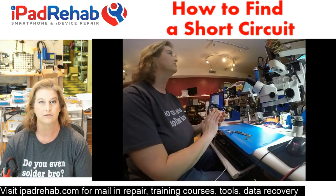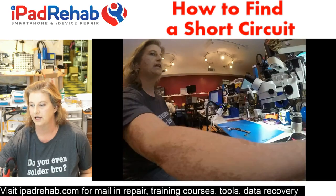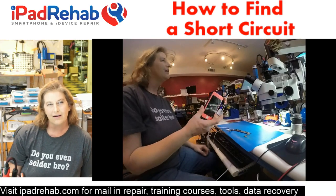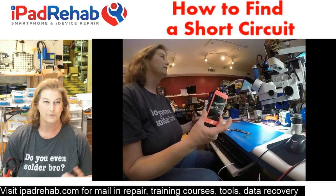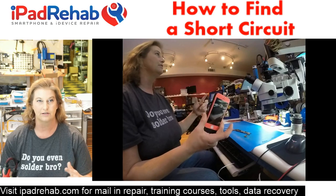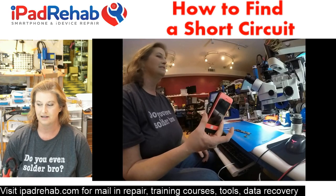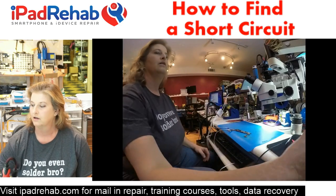So let's sum up what we know so far. We know that the FLIR cam showed us that the PMIC was getting hot, but we're not really sure exactly where on the PMIC. It was just kind of a red square. And we're not really sure if the PMIC was getting hot before other sides of the board. And to do another test, it's very laborious because we have to wait for it to cool down or find a way to cool it down to repeat the test. So this was, to me, time consuming and low resolution.